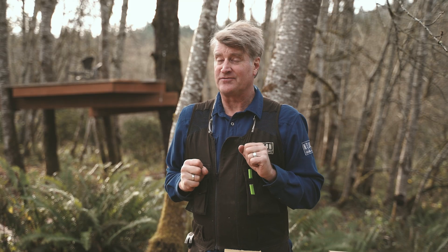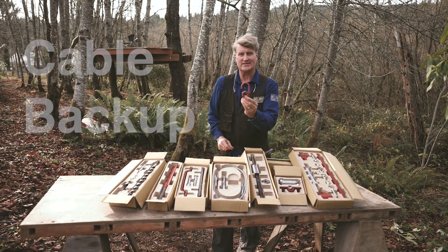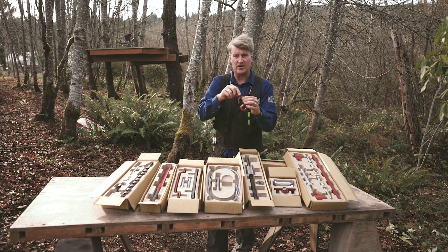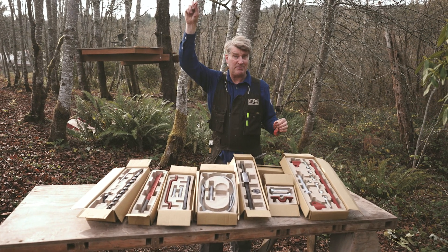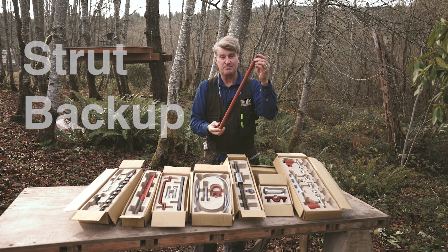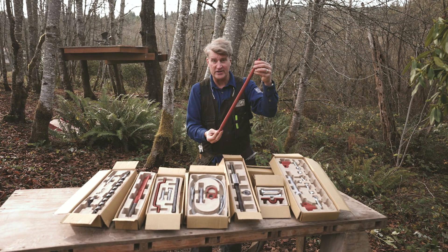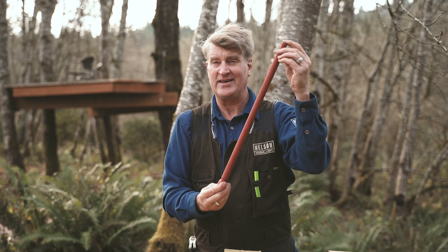We always recommend that you back up the tabs, and we've got two ways of doing that. A cable backup — this nut winds onto the very bitter end of the tab, and then you hook the cable on this part and go higher up into the tree. Sometimes that creates a tripping hazard up on the deck surface. If that's the case, we've got the other option of a strut. This goes below the tab, hooks onto the end there, and goes down lower into the tree with another bolt. This is always important to do on each and every tab.